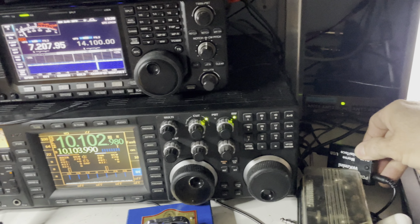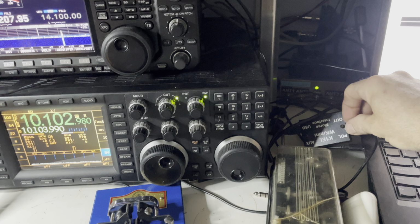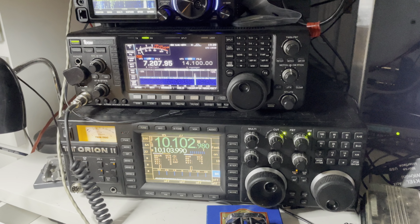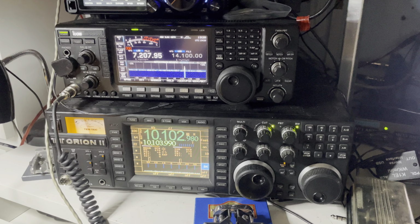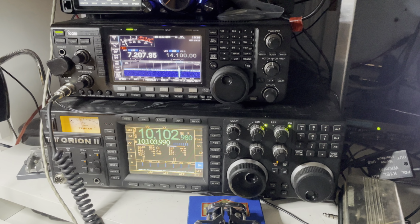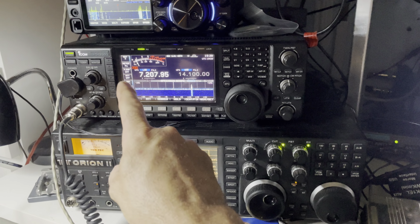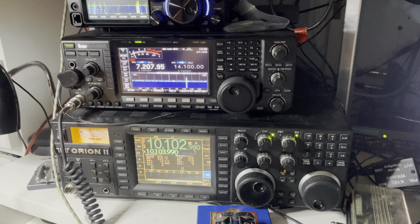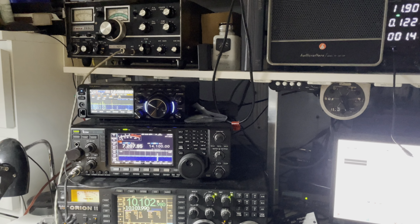Also, man, I've just got so much stuff on this desk. The K1EL WinKeyer allows me to use the PC to control some keying to these radios that don't have that option. The 710 does, but before I had the 710, I was using these radios in some contesting and chasing DX, and it's kind of nice to be able to use memory keying functions from the PC instead of having to reach up and press a button to do keying there, and I can adjust the speed from the PC and use N1MM also. So that's the shack. That's what I've got going on right now, and see you guys later.